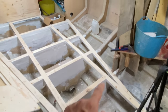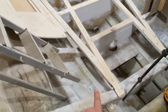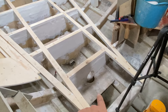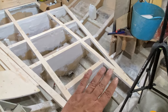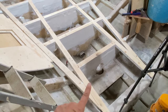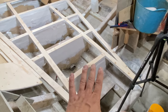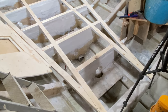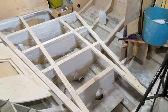So I think the plan is, and we've also abraded the hull as well, so sanded all of that. And we've also done the same down here, so that's all ready for tabbing, and all across the front in here as well. So what we're going to do now is come in with some acetone, and we'll just wipe all these rails. And I think the plan is to epoxy the first part of the floor down. So we'll wet it out first, coat it so that it's nice and water resistant, and then we'll come in with a bead of thickened epoxy and just push that down, and that should go off fairly quickly, 25-30 minutes, I think, for West Systems epoxy. Once that's in place, then we're going to come in and do the sides as well. So let's see how far we get.